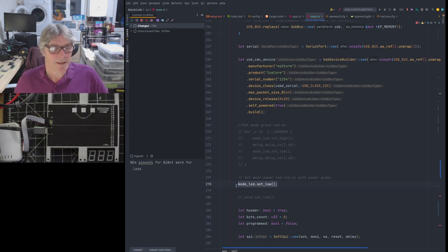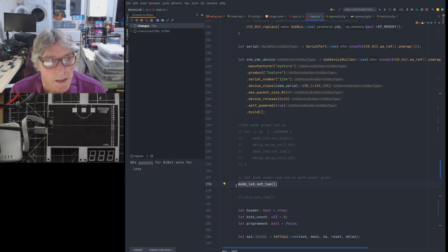The LED on the BlackIce NXT mezzanine board, there's an RGB LED on there, and the way that's wired is there are internally three cathodes, one for red, one for green, and one for blue, and they have a common anode which is pulled up to 3 volts. Now the green LED is automatically grounded.